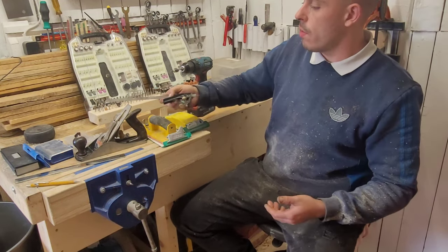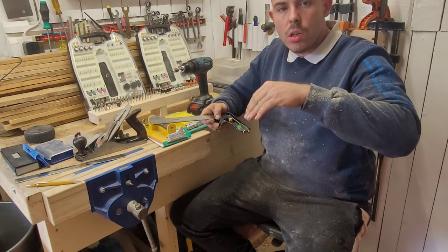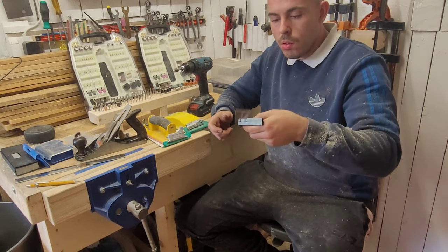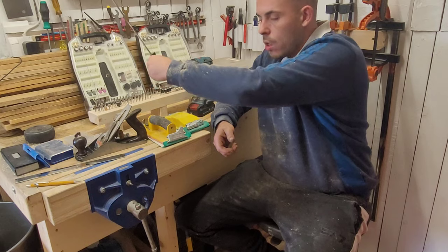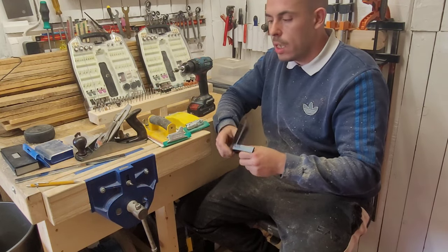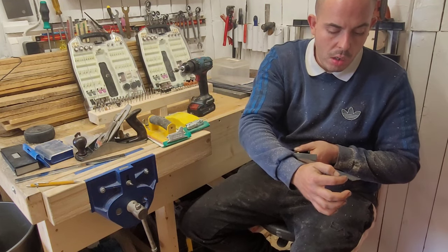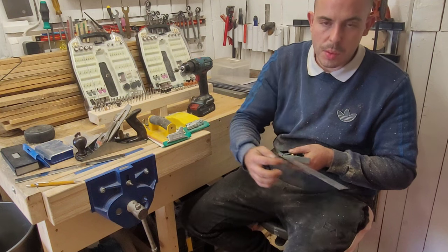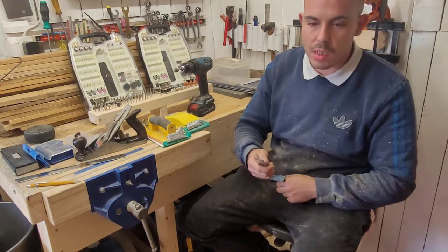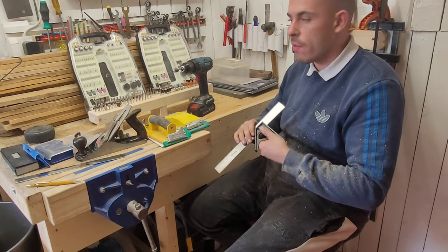You know that you've now sanded, curved over, sanded the edge, so it's got no sharp edges that are going to break and crack easier and that. So just double check, couple of pencil marks, make sure you're doing a straight line. I did them half an inch in and then half an inch between them all. And then I just stabbed the pencil in, instead of using a centre punch or something, just stabbed the pencil in every half inch.